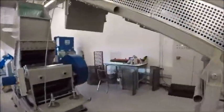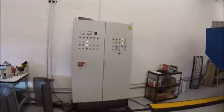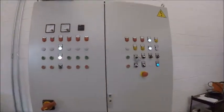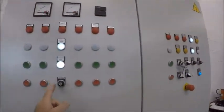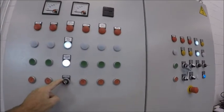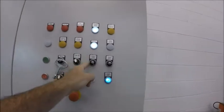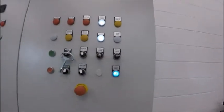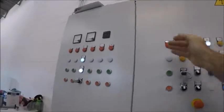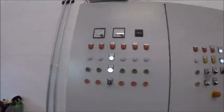You need to adjust the control panel to allow you to work on the machine in what we call maintenance mode. The things you need to do is turn the machine from non-maintenance to maintenance mode, and then prepare the screen hydraulics so you can actually open the screen on the shredder. The blue button — having these buttons lit means it's ready to be in maintenance mode.